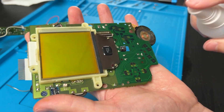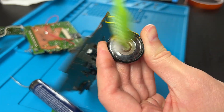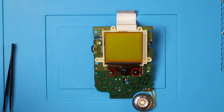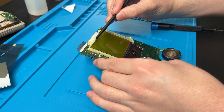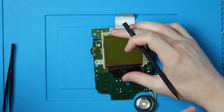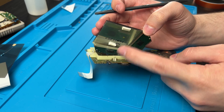Now it's time to mess with the front half. If you haven't cleaned the front half of your PCB, now's the time to do so — I highly recommend it. Just use some isopropyl alcohol and a toothbrush, clean up all the contacts for the buttons. It'll make life a lot easier when you're trying to play. There are two screws down here that are a lot smaller than the rest — we're going to remove those. And this is where I highly recommend a plastic spudger; I would not use any metal tools here. There's a little slot up at the top middle where you can pry the screen up — be very, very careful though. You're going to want to open it like this, the opposite of a book, like a manga. And as you can see in here, it's pretty tight. This is where things are going to get tedious. Very, very tedious.